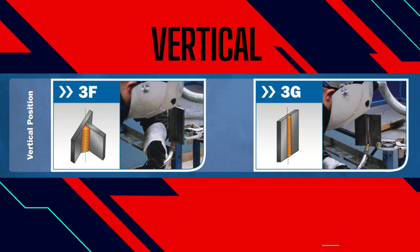Next is the vertical welding position. Operators can complete vertical welds in either vertical up, moving bottom to top in the weld joint, or vertical down, moving top to bottom in the weld joint. Vertical up is typically more common. Welders have to be very skilled to perform this kind of welding because molten metal has a natural tendency to flow under gravity. One has to use a reduced wire feed speed and voltage to ensure the puddle does not fall out of the joint. It is recommended to use a 90-degree travel angle for a 3G weld and a 45-degree angle for a 3F weld.